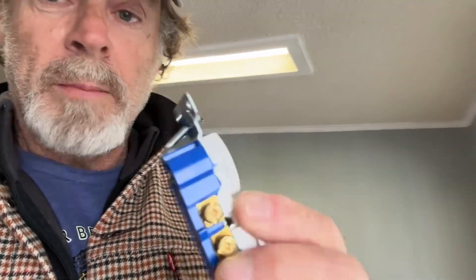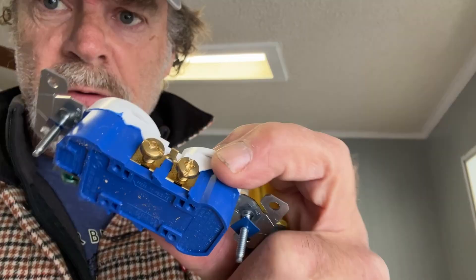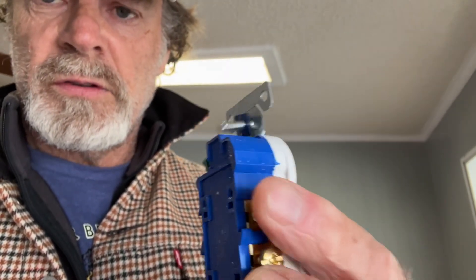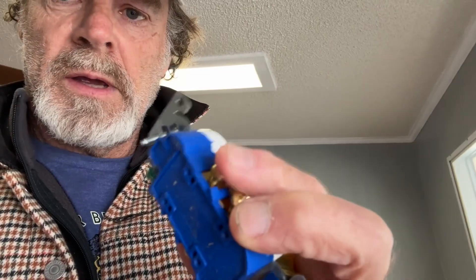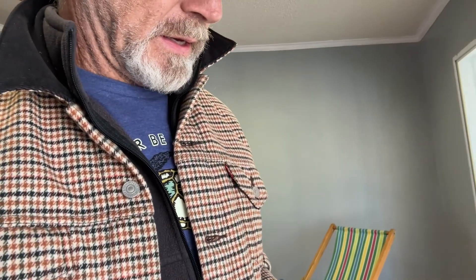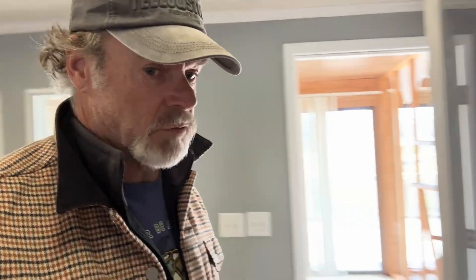What I'm going to do — and what I recommend you do — is turn your power off, shut your power at your circuit panel, and go through and change all these outlets the right way using the screw terminal. Your problem may well be solved because that's really what it is.